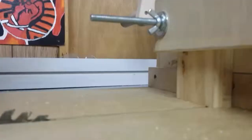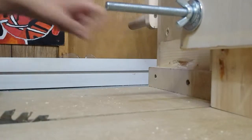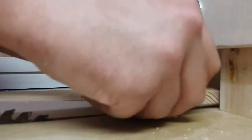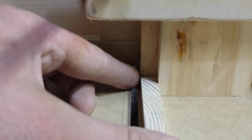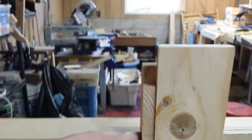Here's how it works. This is my half-inch spacer that I'm simply using to line up the box joints — they're going to be half-inch wide. I use this spacer to make sure I'm a half inch apart, then tighten it down so my first cut will be a proper half inch from each other. Double check up here — looks good — tighten this down and we'll start cutting.